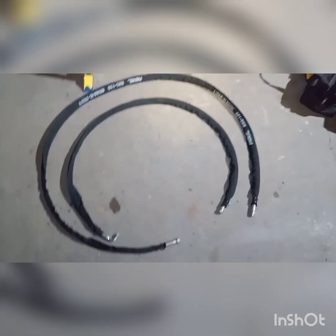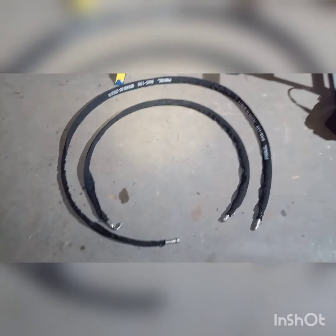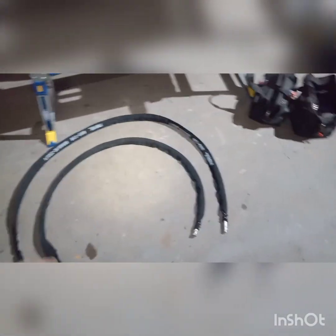We're going to run two hoses — you could do it in one hose or five, hydraulic fluid doesn't care. I did two simply because it's the easiest way: if one hose gets a hole in it, I can just replace one instead of fishing the whole thing through.